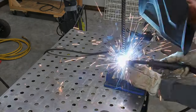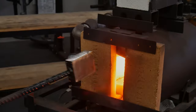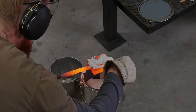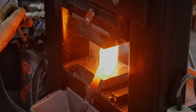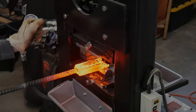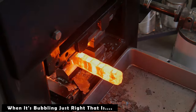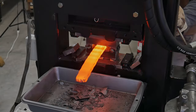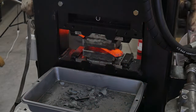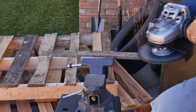Note that when welding up the first billets, I put a weld down the side to hold the thin pieces together when heating up in the forge, but with these thick layers in my stack, I found that's not necessary. I used Mule Team Borax for flux with this weld, but in today's world I just use kerosene again. I may have done this to gauge temperatures in the forge, since the visual state of borax can be indicative of forge welding heats. Either way, it got the job done. The steps here are very similar to the first round — I made sure to lightly set the welds with the first heat or two, then proceeded to draw out the billet using the same principles about scale, uniformity, and flatness.